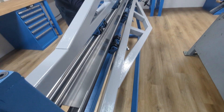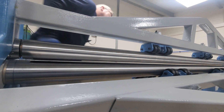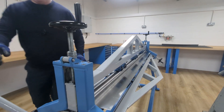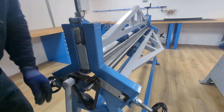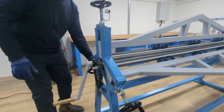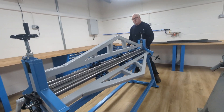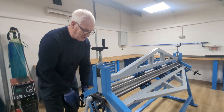You can see that gap closing, so what we've got to do is just put these rollers down till you can't see the gap. There we go, let's give this a go. Now remember these are all independent as well, so we can adjust them. They'll give us either a lazy curve or a tight one - the tighter they're all together, the tighter the curve will be.